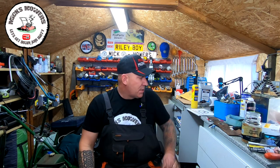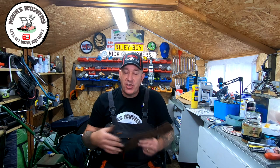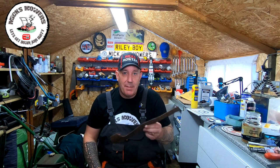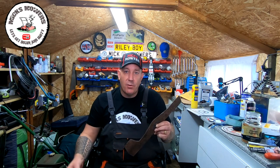The blade should also be well balanced. Before you sharpen your blade, you need to take the blade off your machine. This is done by removing the HT lead first so the machine is made safe. Once the HT is taken off or the spark plug removed, you can tip the lawnmower on its back or side, however the manufacturer recommends. Then by putting a spanner or a breaker bar on it, you can remove the blade itself. You may struggle without an air gun — I recommend putting your foot between the blade and body, or you can purchase a blade stop off eBay or Amazon which bolts to the side of the engine and stops the blade from spinning.